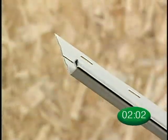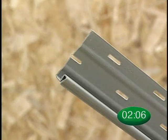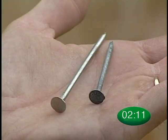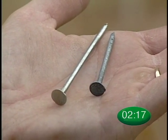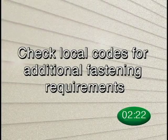First, it is necessary to use Crane Performance Siding Underlayment Vinyl or Steel Starter Strips, which are specifically designed for Solid-Core Siding. You'll need to use at least a 2½-inch long roofing nail or equivalent when installing Solid-Core Siding. In some cases, local codes may have additional fastening requirements.